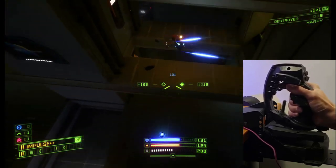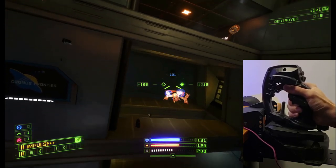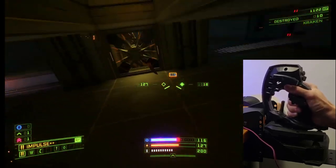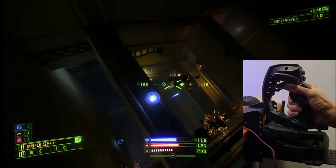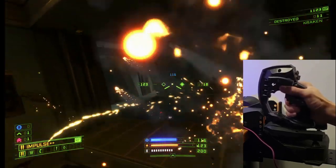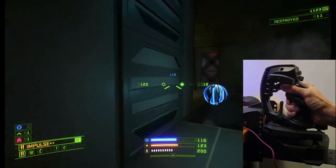The precise force sensors act through a multi-part suspension system so that force can be applied at the handle's center without causing rotation. This provides a blend of kinesthetic feedback, like a traditional motion-based stick, with the reaction speed and sensitivity customization associated with force controllers.